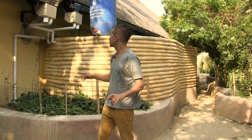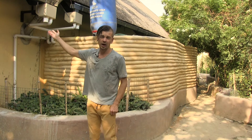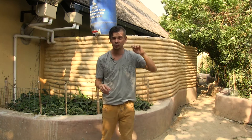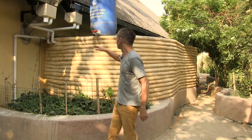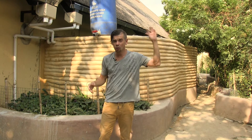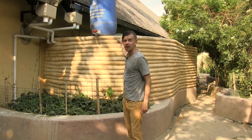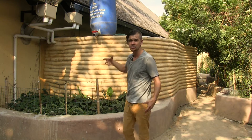You get a variety of leaf catchers. We have a leaf catcher here which basically stops the bits and pieces from going into the tank — that's a corporate-made one. And here's a low-tech handmade leaf catcher, or first flush as they call it. What happens is on the first rain — let's say it hasn't rained for a few months — the first rains and all that dirt fill up this tank. It has a mesh screen on top to stop leaves, and when the tank is full a tee piece sends water through to the main water reservoir, so the dirty water fills first and then the cleaner water goes through.